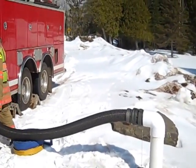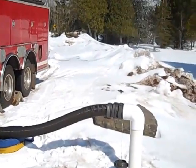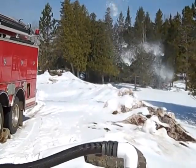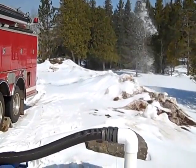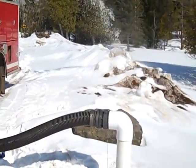And if you can't get the draft, then stop and check for leaks. Check for all of your connections — it doesn't take much to get a leak. If there's any air coming in, you're going to lose your prime. The connection at the dry hydrant will be the first place I would check.